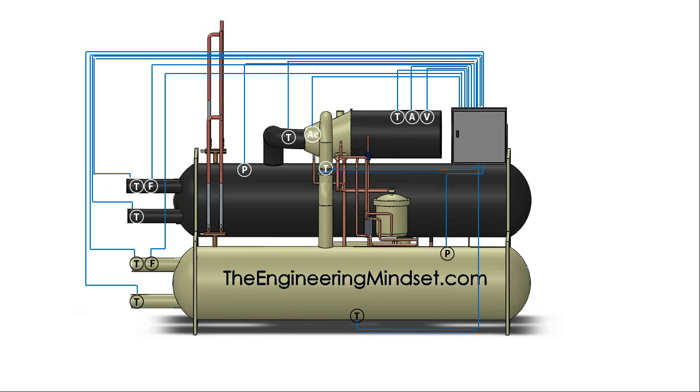There's another circuit which runs around the chiller — the oil sump pump. The oil sump pump pushes lubricating oil around the machine, into the gears and into the motor, and this is to protect the motor and the gears. This lubricating oil stops the gears and the motor from overheating and basically stops them from wearing out. For this system, the temperature and pressure of the lubrication circuit are also monitored.